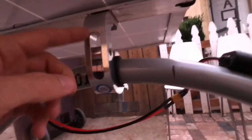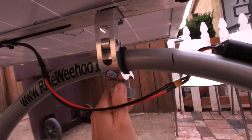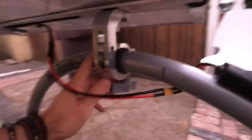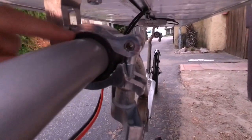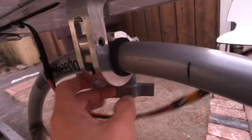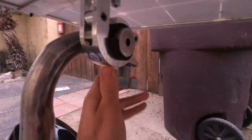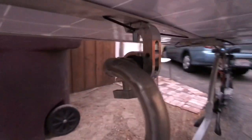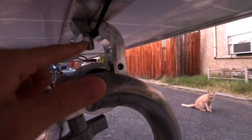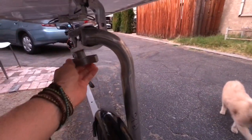Here underneath you can see how we put this together. These are for studio lighting — we'll put a link to these. In the studio you loosen this clamp — this is basically just this clamp. When you loosen it, here this is just a water hose fitting for a car, and that's what it clamps onto. So when I loosen that and loosen this one, you can see we added this — it was welded on here, bends over, and then this part comes out and that's where this clamp goes. So I loosen this and it bolts up in here. The solar panels are held on with a bungee cord, so when that's loose you can see that we can angle these.